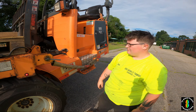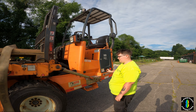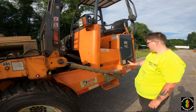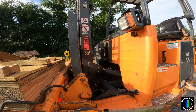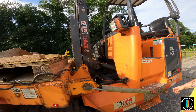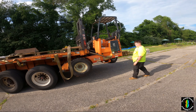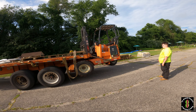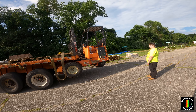Press the down button on the Moffett. Whenever you're traveling, your Moffett should always have all of its weight resting on these safety chains, because if not it'll wear out the hydraulic system and you'll probably end up needing replacement parts. That is beautiful — there are some things we could have done a little better, but this is her first time mounting it up and she'll get better with time.